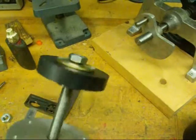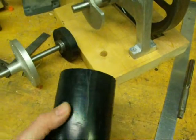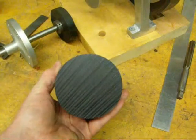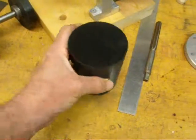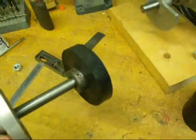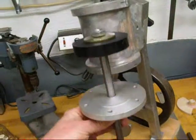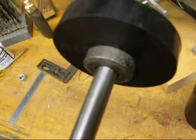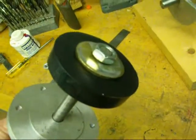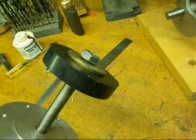Now I'm turning my attention to the piston. There will be no piston rings, packing, or O-rings — it's just a close fit; that's good enough. I'm using this plastic that came from my brother Jan in Cody, Wyoming. It's about three inches in diameter so I've got to turn it down a bit. I've already cut off a piece, drilled it, reamed it, and faced it on both sides. I've put a collar — or bushing — on there with a roll pin to hold it in place on one side of the rod, and on the other side just a big flat washer and a jam nut, which I'll probably Loctite.